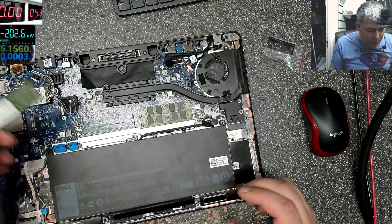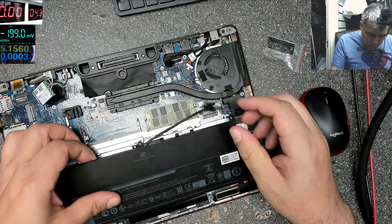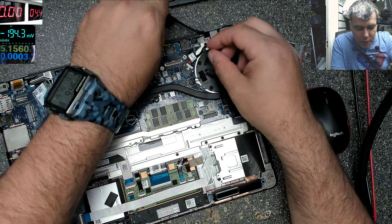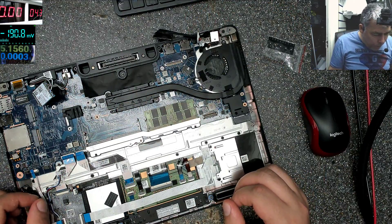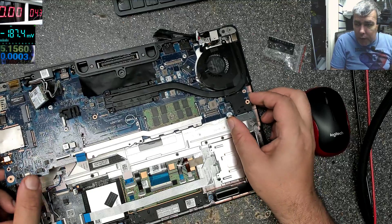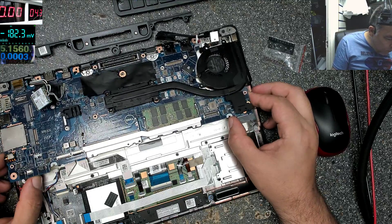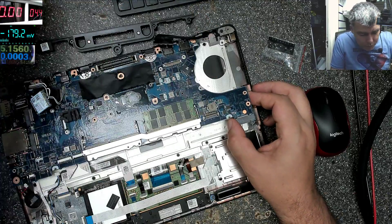Anyway, let's replace this chip and let's see if it's right or not. I know I have a video on this computer with the first part. I think I was pretty accurate based on the fact that when I applied 3.3 volts from the power supply on that power rail, the chip was getting hot. That's what I remember. So let's just replace the chip and if it's not working, we'll go from there.